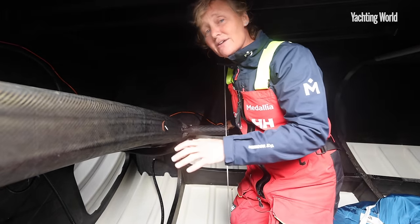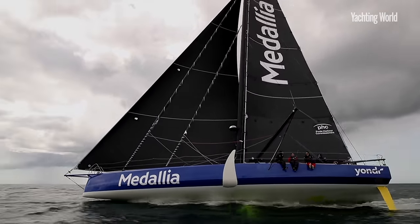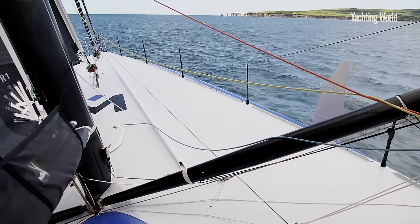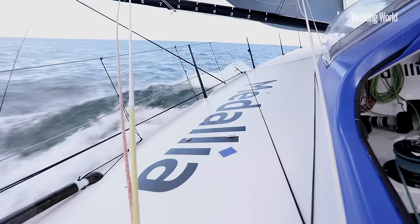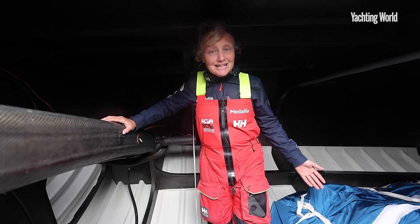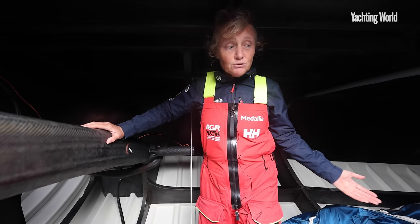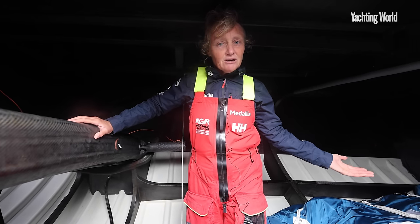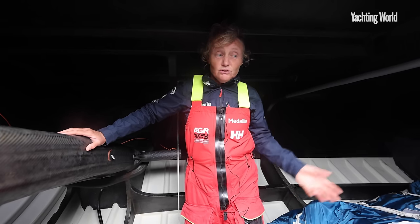The reason for raking the foils is it lifts the bow up. And I play with it a reasonable amount, because it makes a significant difference to the amount of water that's coming over the bow. So if there's a lot of water coming over the bow when I'm starting to go at 20 knots and catching up the waves, then to stop the bow from digging into the next wave, you need to lift it up — so I'll rake the foils. And then you'll get to a point where conditions are a bit wild and the bow's a bit too much in the air, and then you need to back it off. But it's definitely something that I've needed to learn to trim in the same way that you trim a sail.